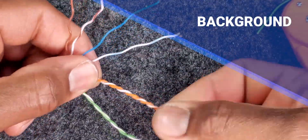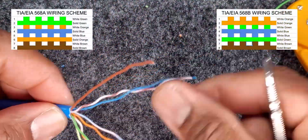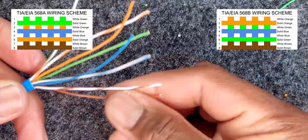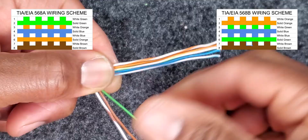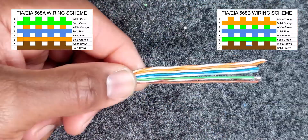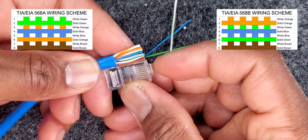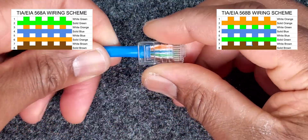Now let's look at the background of this cable that needs to be constructed. The cable to be constructed will be a 4-pair unshielded twisted pair crossover cable, meaning the colors of wires on pin 1 on one end will not be the same as pin 1 on the other end. Pin number 2 will not be the same as pin number 2 on both ends, and so on. Pins number 4, 5, 7, and 8 would remain the same on both ends. The only pins that are going to change would be pins 1, 2, 3, and 6.